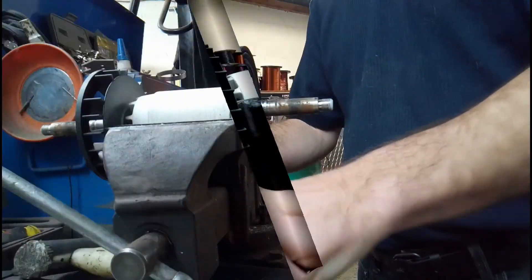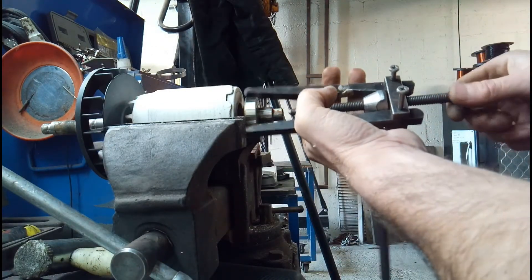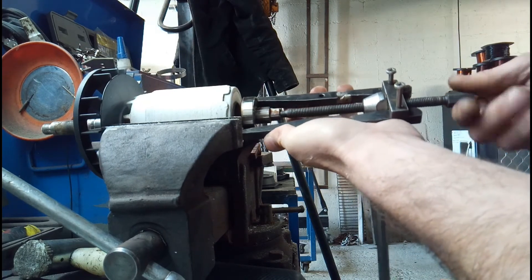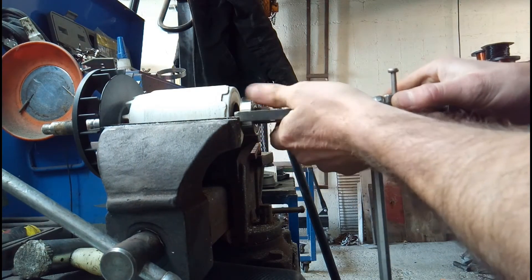Now there are a lot of pumps out there which actually come out brand new with steel shield bearings. This is something that is a huge no-no in my opinion, as they'll sit over winter and just seize when you go to turn the pump back on again.